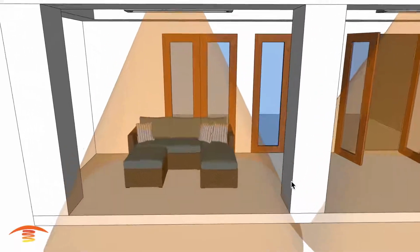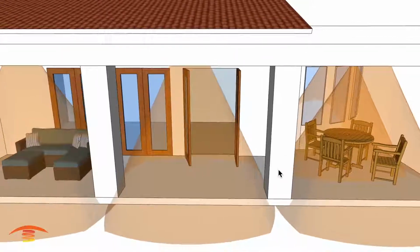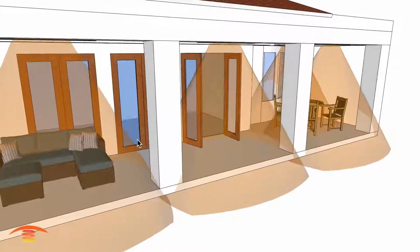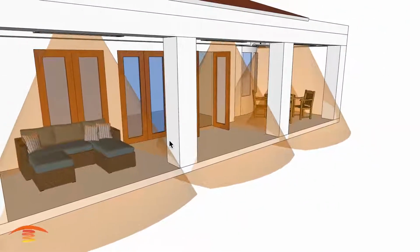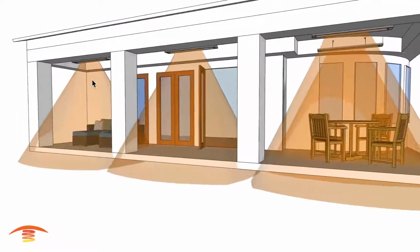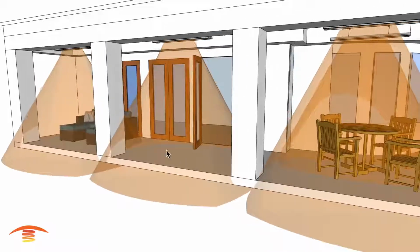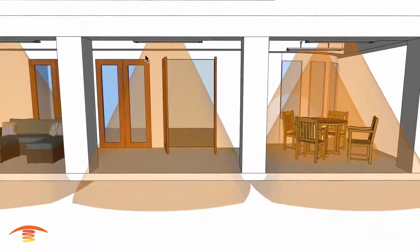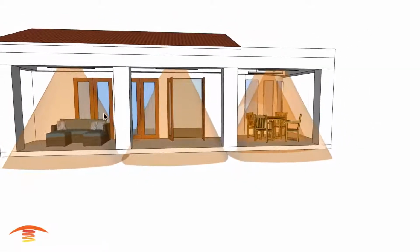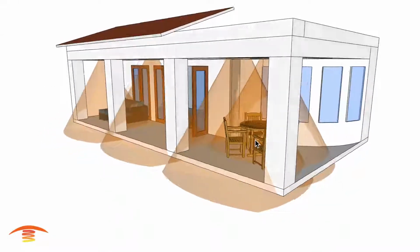So in any case, we do have these little spaces here and here that'll be underheated. I think that'll be okay. There are people that are warmer than others, so there'll be occasions where you might have somebody standing out here because they want to be out of the heat ray itself. So I think that'll be fine. And also, I would highly recommend placing these on a control system, because they are a hotter unit. And if you had a cocktail party or something of that nature where you had people standing up here, you probably would want to have this reduced as far as its output. And then also I put it on at least 2 zones, zone 1, zone 2 over here, just so that you can have flexibility with how you're using your heaters.